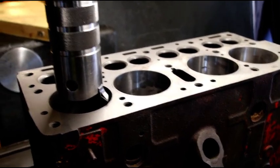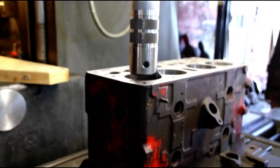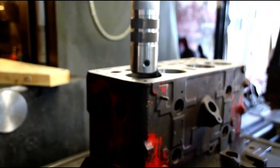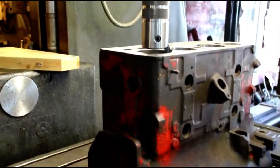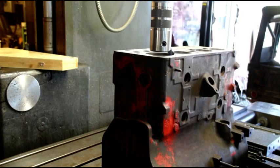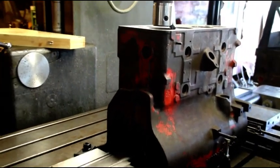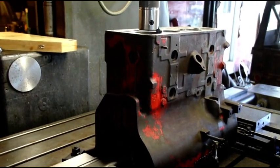I left very little in cylinders two and three for honing - probably only one thousandth. The nice thing about the SIP is I can take the bores right to almost finished size. I don't normally like to do that - I normally like to creep up on it with the hone - but because I was moving those holes, I used every bit available. We're just going to have to tickle it with the hone, and that shouldn't be a problem. The most any cylinder is off right now is about six thousandths, which is not terrible. With the precision of the SIP you can really pick up and see what the last guy did.